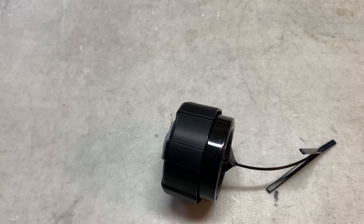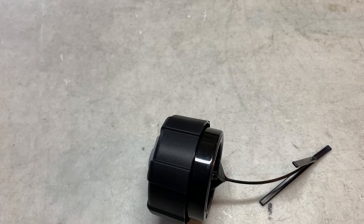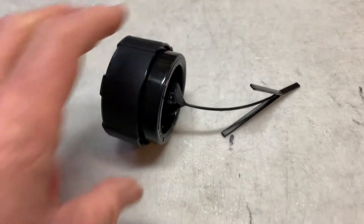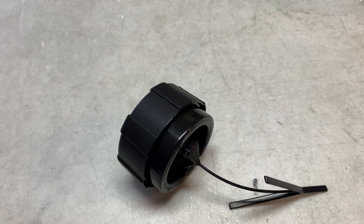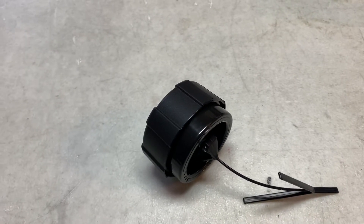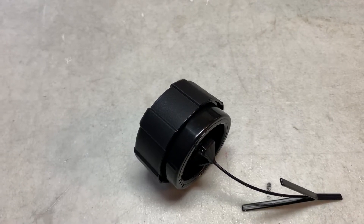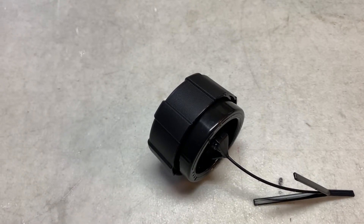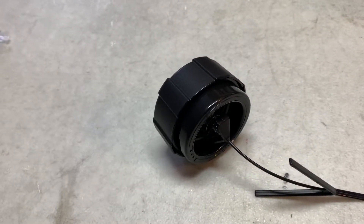Once you drop the line into the auxiliary gas tank, you're fine — you don't need a seal there. But everything else has to be sealed perfectly. These generators have a fuel pump in them, but it's not a very powerful pump. If you don't have a completely airtight seal along the pathway of the fuel line, it'll suck air and you will not be able to draw the fuel to your generator.